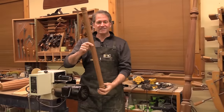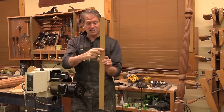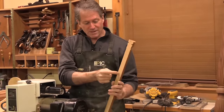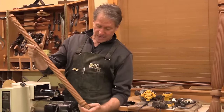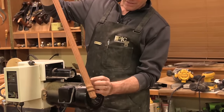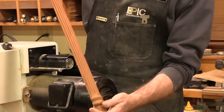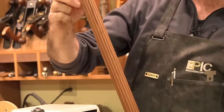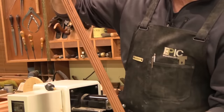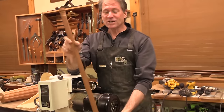Also, this is actually cut off from quarter columns from a chest of drawers that I made some years ago. It was actually a whole round. So when you make the quarter columns like this, you glue up four quadrants with heavy paper between the quadrants and then turn. I don't know if you can see this, but that's actually a classic kind of Greek column where you have beads down here and then you have these coves all in, or sometimes it's called fluting. So they're a series of coves and separated, and then at the top you have this other classic detail. This gets cut off, but then after you've turned it and cut your coves into this with this technique I want to share with you, you then split the pieces apart, and because it's heavy paper, it just tears apart, and then you have the quadrants ready to glue in to the quarter columns.